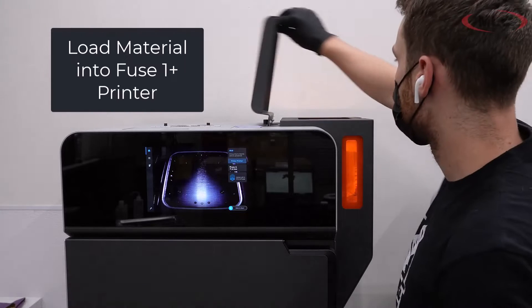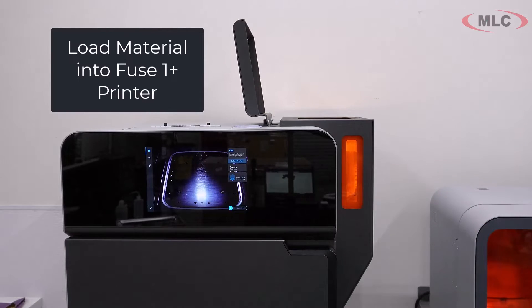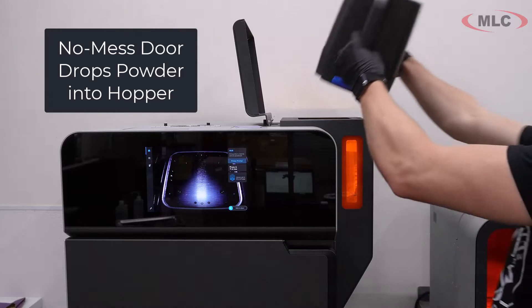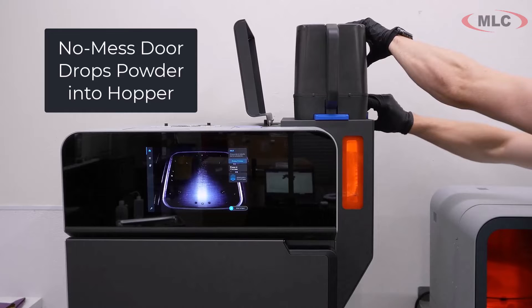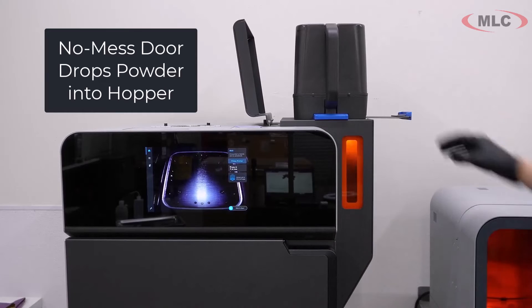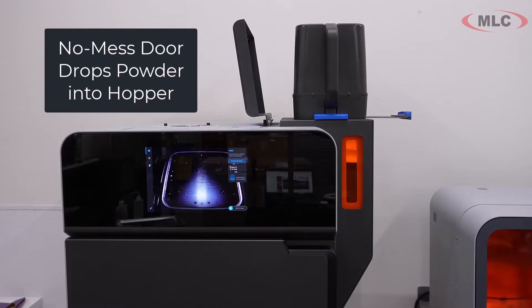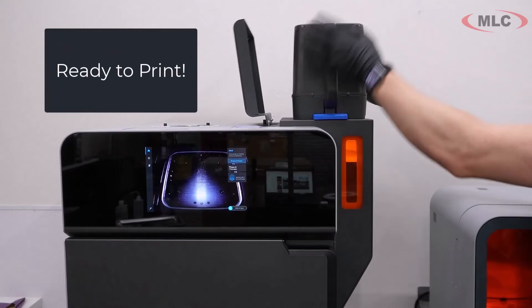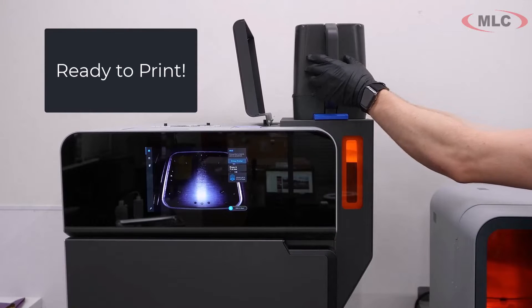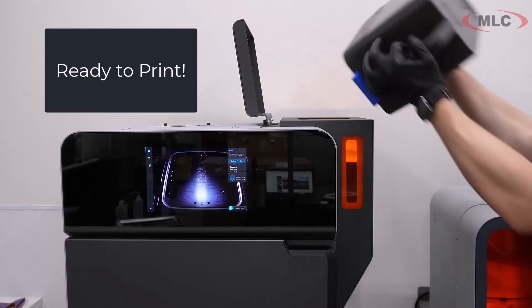You'll come over here and load this into the Fuse. Now you're dealing with very loose powder — extraordinarily fine powder. But because everything's self-contained and fully contained as you go, you'll notice that you kind of set this on top and then pull a trapdoor, and that's what drops that powder into the machine. So you don't really ever have to worry about it — you'll see the powder, but you're never going to be dumping it anywhere that's not a controlled place.